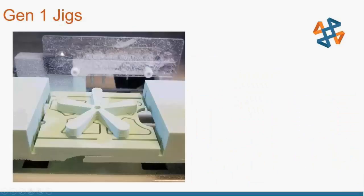Okay, yeah, so now let's go into the tips and tricks of what I learned from it. So the jigs, we like weird jig shapes really help for it to stick into your foam. I liked using the 90 pound foam personally. Very, I'll say, cost-effective. It's lightweight. It's really fast to mill. And then when it wears out, you can toss it and build a new one, and you're not really attached to it. So I really enjoyed that.